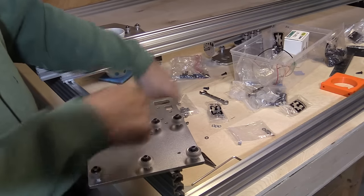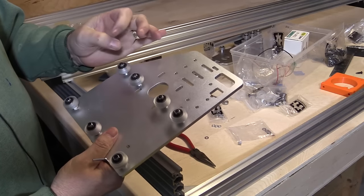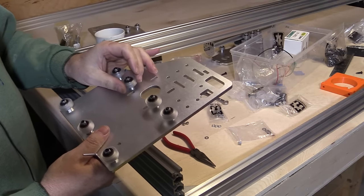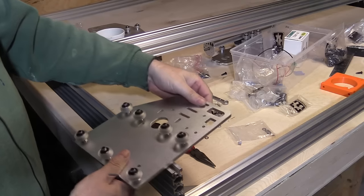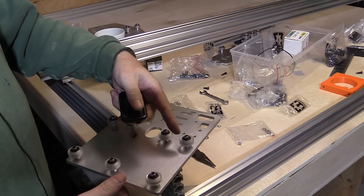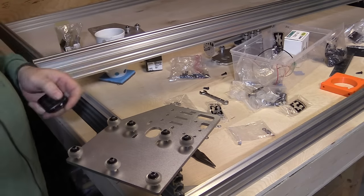When you tighten down any of the wheels, you don't want to tighten them right up immediately, because once they're on the rail you might find a little bit of play on one of the top wheels — one might not be turning as well as the others because it's a little looser. So wait until you get them on the rail, then put a bit of pressure down and tighten them all up together to make sure they're all in an exact line. It doesn't take much — fractions of a millimeter — for one to be very tight and another to be quite loose. You want to even the wear out and minimize your vibration.